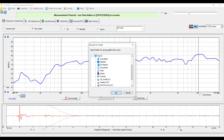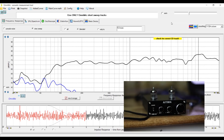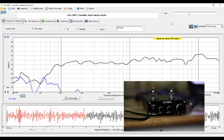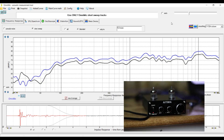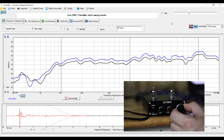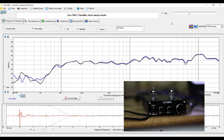I'm going to add another live curve to allow a direct comparison between the preamp and the amplifier. Setting the volume control to halfway, let's test what this does at half volume on the preamp. Are we going to get the same frequency response, or higher or lower? You'll notice we are getting a little bit higher — almost five decibels higher at half volume. So where do we need to go to get back to our baseline? Turning it down, at about two-thirds of the way down, we get the response to be about the same.